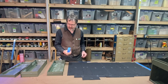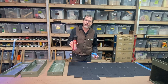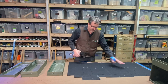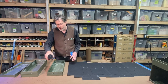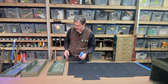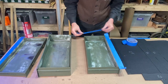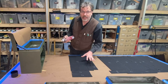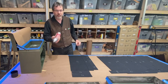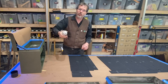I've got all the felt cut and ready to go into these drawers. What I'm going to use is Super 77 contact adhesive. I like to spray it onto the bottoms and sides of the felt, and then another coat into the drawers themselves, wait a little bit, and then stick the two together. But first I need to mask off the sides of the drawers. I've got these pieces of felt laid out and the tool chest all masked off for the Super 77. I'm going to start here doing the top of this right here and give this can of spray 77 a good shake.